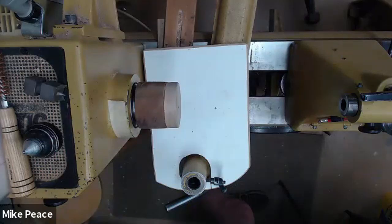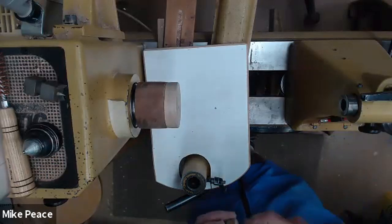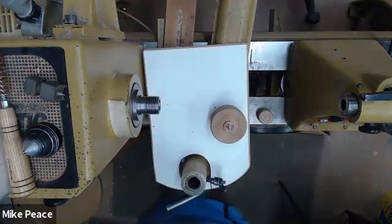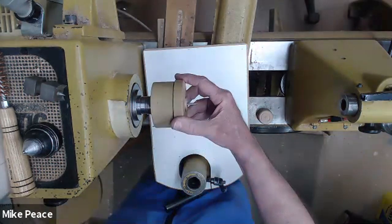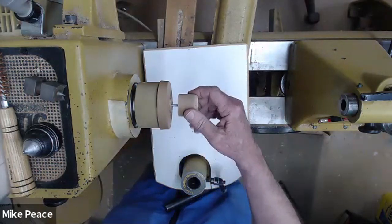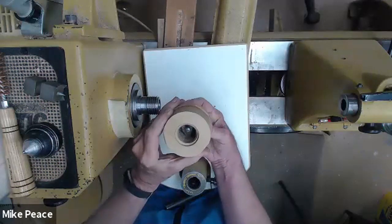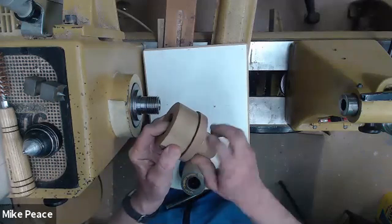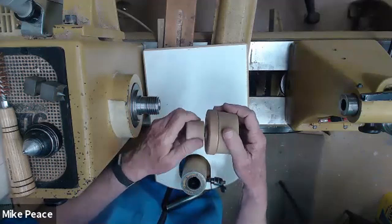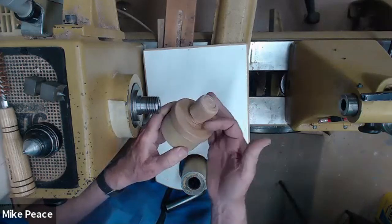But those screw chucks can work very well on any number of projects. One example that I would use it for is if I'm turning knobs. A screw chuck can be the most effective and most efficient way to turn something, because you drill a hole and you screw it in there, and you may have to use a screwdriver to finish tightening it up, because a lot of times when you turn this, the screw is turning behind it, and that's okay. It doesn't have to be permanently fastened, but you just put this in there. You use a screwdriver to hold it and pull it tight, and you can size the base with this little tenon below it. You don't have to worry about hitting any metal if you're turning.